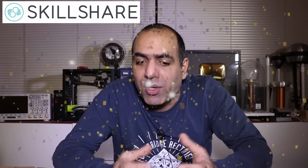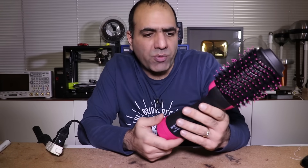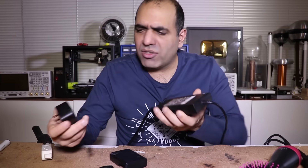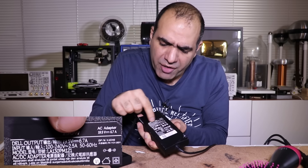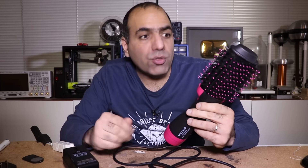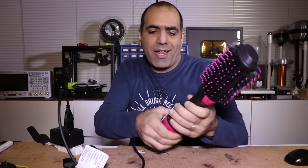The best gift you can give yourself or anybody is knowledge. So yes, we can plug this into the 120 volt AC line and it will turn on, but at half the voltage we only get a quarter of the power out of it, so it won't heat or blow enough. There are tons of electronics with their own switching power supplies — like a laptop or mobile phone charger — that support the entire input voltage range. But things like an iron or hairdryer don't. So here's a transformer that outputs 240 volts — you plug it into the 120 volt and plug your hairdryer in.